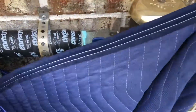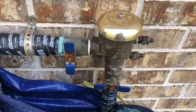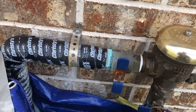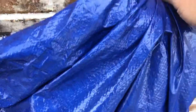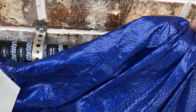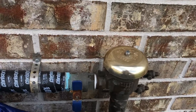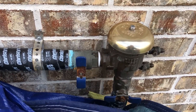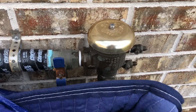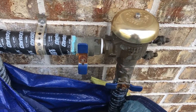This is pretty much foolproof. I have blankets and tarp here to cover this, but even if I don't cover it, it will probably be okay. It might freeze but there's no pressure, so it likely won't crack. There are plastic parts in here though, so I will still cover it with blanket and tarp just to make sure. Bleeding solves 70–80% of the problems, but covering it protects the plastic valve parts. Thanks for watching.